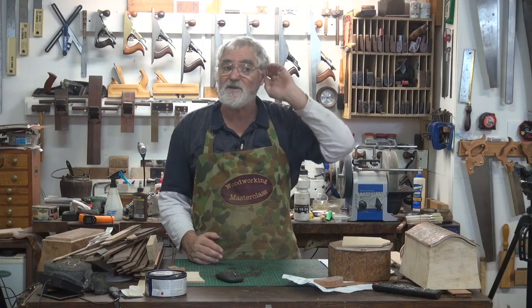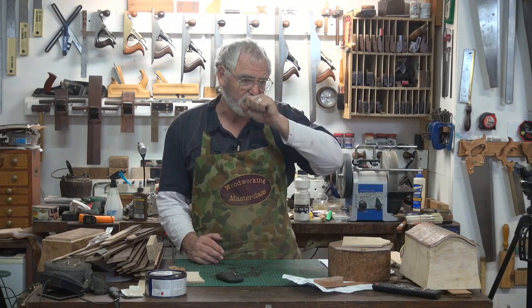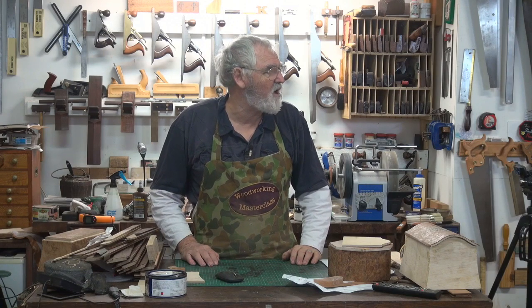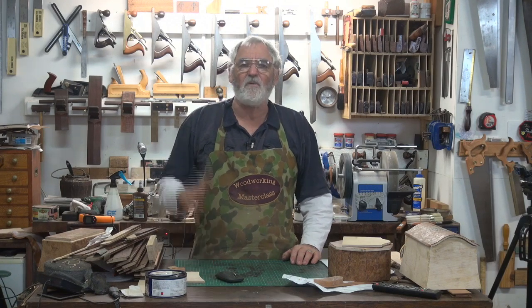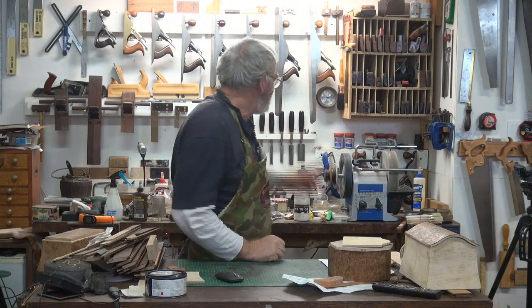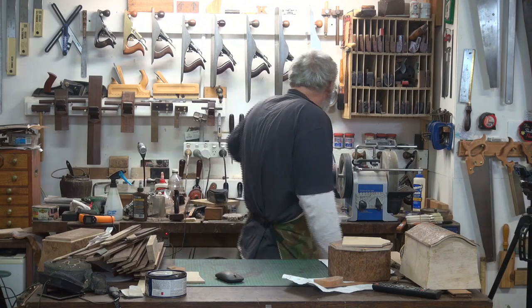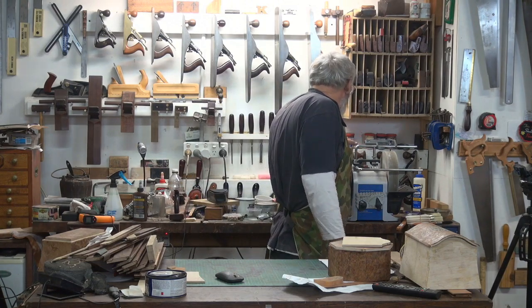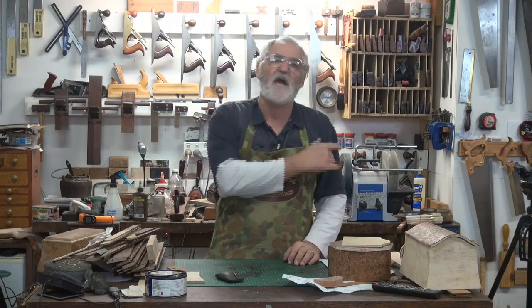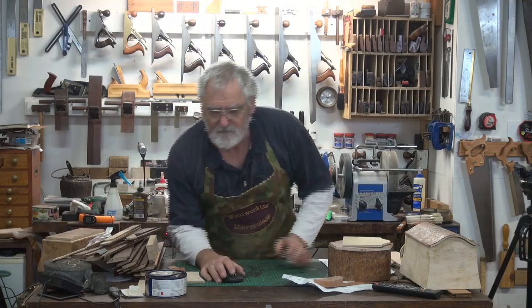But this is what I do. If I'm going to stain the job, with Van Dyke crystals or whatever, I'll just use the TimberMate colour that I use the least to grain fill, because I'm going to stain it anyway and it won't matter. That way you utilize all your stuff. But that's great stuff, TimberMate. It really is.